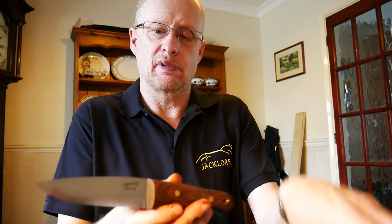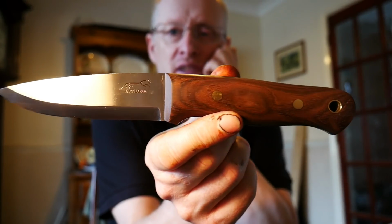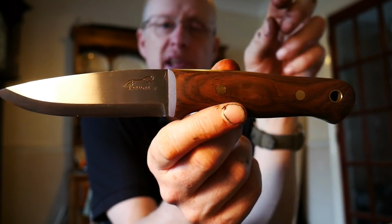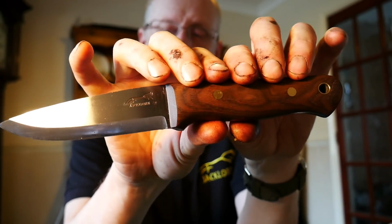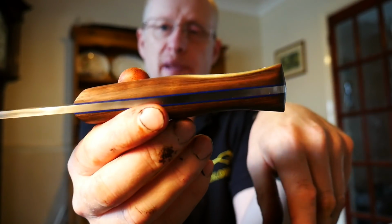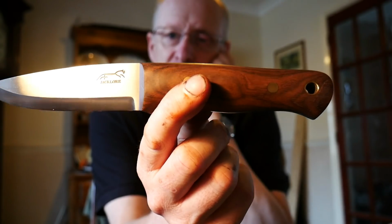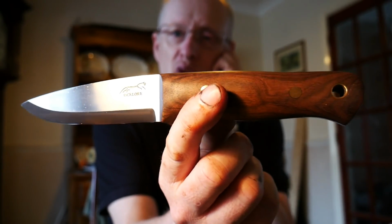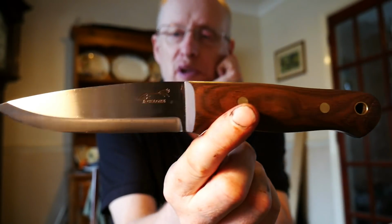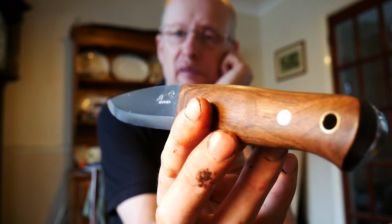again to the more observant, you'll notice a difference there. It's a scaled up classic. I've made it from 5mm deeper thickness of steel. It's still 4mm thick, untapered. But I've increased the depth of the blade, and not only that, I've also dropped the pommel down by 5mm, and I've dropped the tip down by 5mm. So it gives you that drop point, that real drop to the blade.